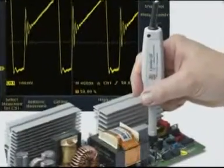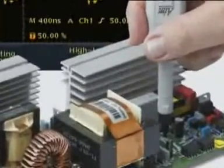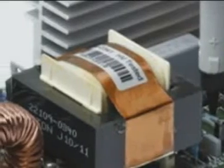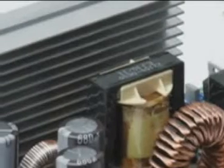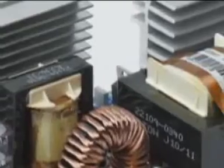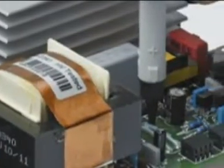Users must consider all fields that will be present in the area of the probe tip. In all cases this will include the Earth's magnetic field, which when north-south across the probe tip will present a field of approximately equivalent to 200 milliamps. In addition to this, magnetic fields are also developed by wound components, metallic component parts, and also adjacent multi-layer tracks. Consideration of these adjacent fields must be taken.